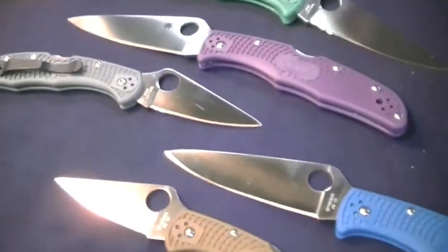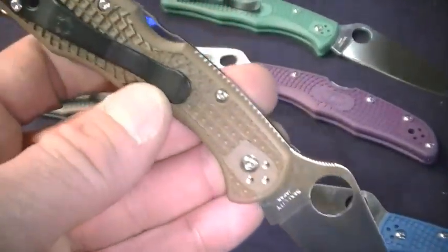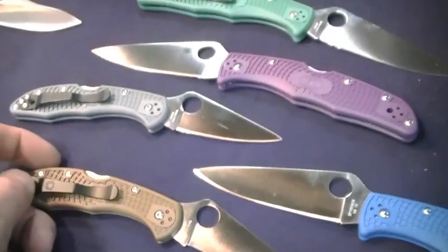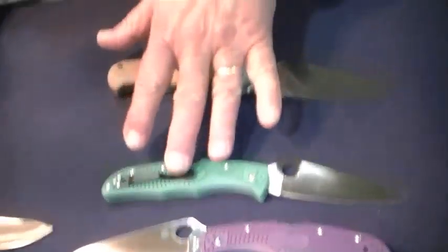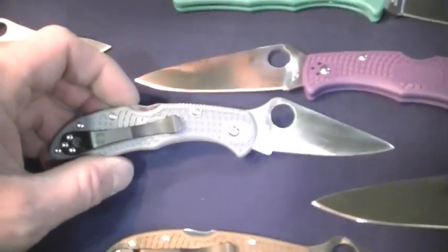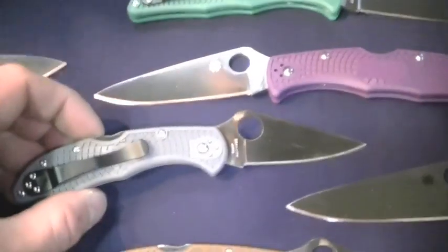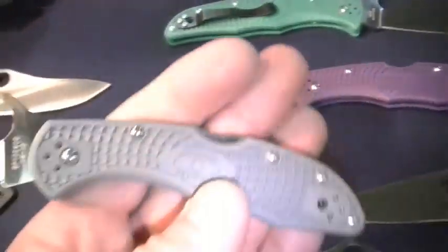If the full flat grind is preferred, then we will do a conversion, certainly of the lightweights. We may still keep the stainless models saber. Okay. And the H1 models, you mean? No, the H1s have to be hollow ground. Okay. H1 cannot be flat ground. Interesting. At least we can't flat grind it. The colors were selected by various managers. We each had to hone in on a color. Great choices, I say. We'll see how they come out.